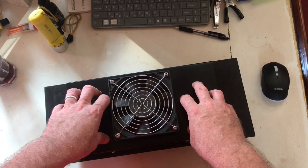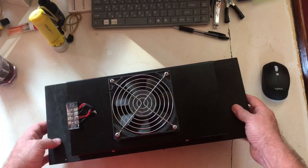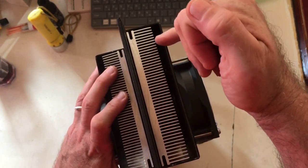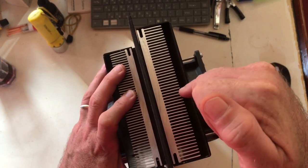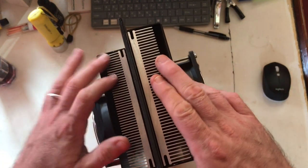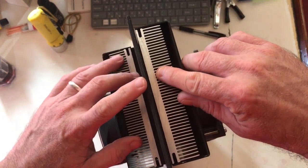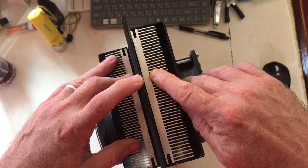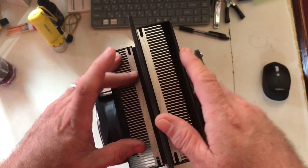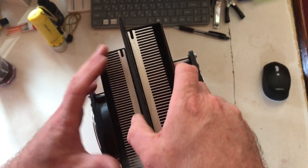I had the Peltier units made to my specifications — a lot of trial and error, a lot of mistakes. Even on the spacing of these fins we went through four mil, six mil, to even eight mil, having them longer, milling this aluminium billet. I worked with electrical engineers and mechanical engineers to make this work. I don't sell these — I made them for my off-grid lifestyle.